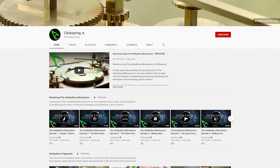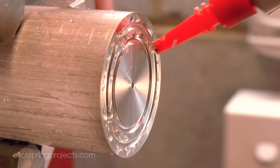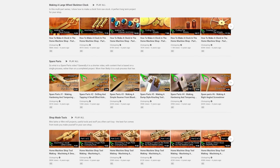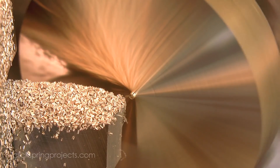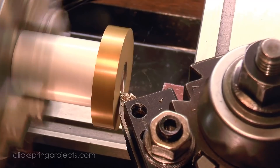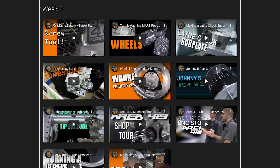Chris, over at the wonderful YouTube channel ClickSpring, has long been a user of the super glue technique and has his own tips and tricks on using it, especially for smaller lathe parts. We'll have a link below to Chris's full video, and we asked if he'd offer a quick preview. G'day folks, Chris from ClickSpring here. Super glue is one of my go-to methods for turning hard-to-hold parts on the lathe. You'll often see me leave a center tip on the workpiece so I can use it to register the part again on the mandrel for future cuts. The NYC CNC page will have all these videos listed out, as well as all the other fixturing recap series videos. Hope these are helpful, hope you learned something, hope you enjoyed. Take care, see you soon.